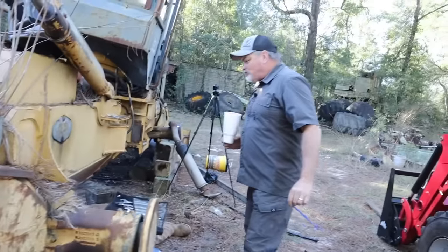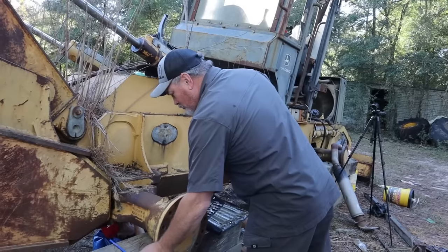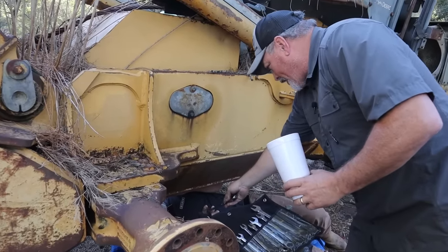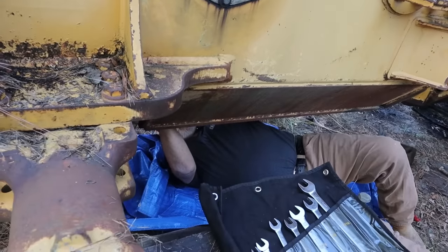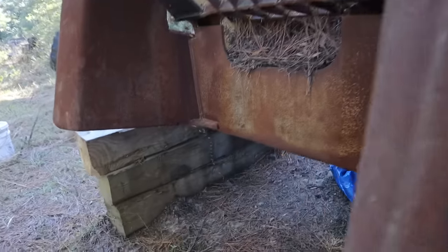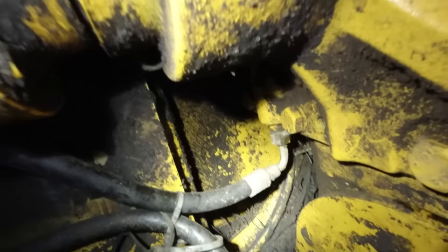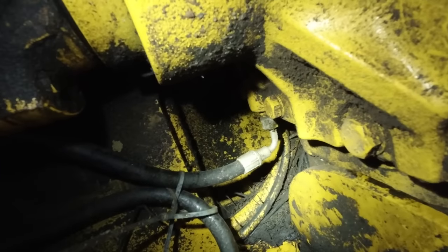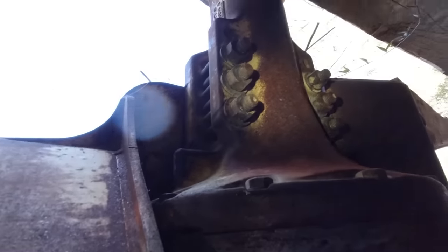Okay. Can you hand me like a 7/8? The good news is it's just one hose. And the other good news is it broke pretty easy. There's what we're up against right there. But we gotta take this U-joint out, undo that one hose, and then got 6 bolts on both sides to take off. Hey, I'm gonna go get the liquid wrench and start spraying these nuts now. Okay.